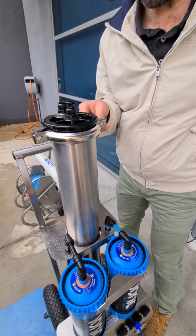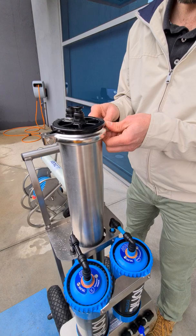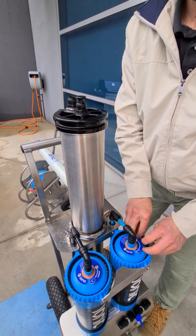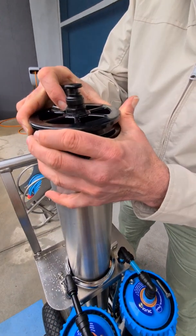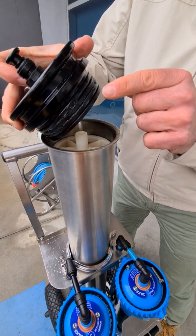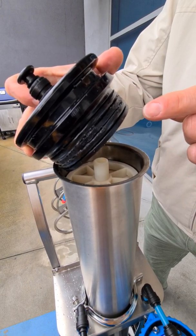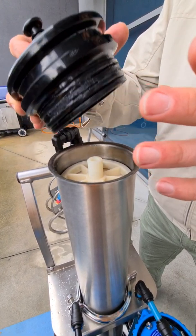Once you get them out of the way, you'll remove the clamp. On both ends of the housing assembly, the end of the housing has quite a large cap. That cap is pushed into place, and there are two quite substantial O-rings on this housing end cap. You can see there's a little bit of O-ring lubricant — Vaseline. If you don't have any, put some back in liberally. That is the cap end, and you would put that aside.